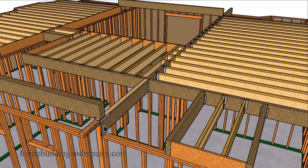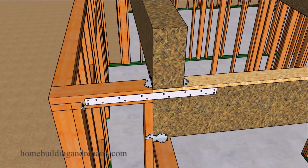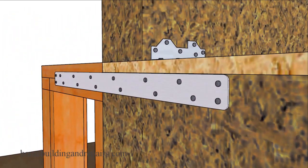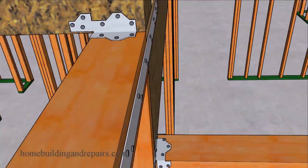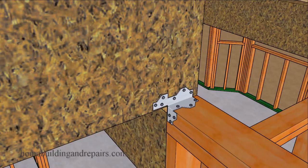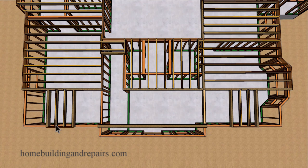Another view of the long structural connection from the front of the house to the back. We're going to use another strap to connect the wall framing to the beam, along with some building hardware to connect the beams to the wall framing or other beams. You can always use stronger connectors — an engineer might actually call out for different connectors. This beam will help tie this wall together so we get a nicer connection between the sides.